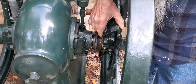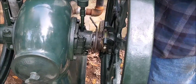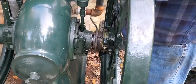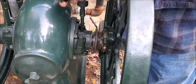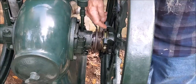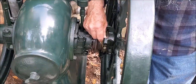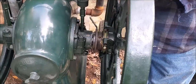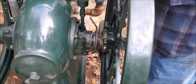That one fit quite well between there, but the paint buildup — there was no paint on that pivot shaft itself, but on the edge of this right here there's a real thick coating of paint, and on the inside of this yoke part is a real thick coat of paint. Once you get a thick coat there and a thick coat there and a thick coat there, then this don't pivot no more. So I'm gonna remove all that paint and clean everything.